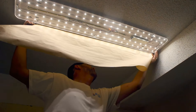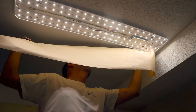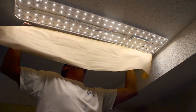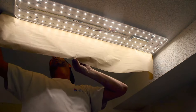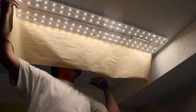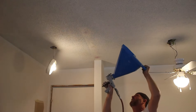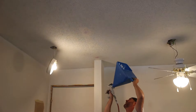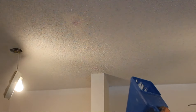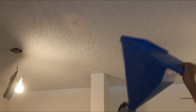The first thing we had to do was spray out the ceiling, so here I'm masking off one of the lights that I wasn't able to drop down. This is a concrete building so this light was anchored in pretty good, so we went ahead and masked it. Before we could paint, we had some repairs in the ceiling to take care of. Here I'm spraying spray texture back up and blending it in with the old — you'll see how it blends in nicely with the hopper. You can rent these hoppers at any of the big box stores.